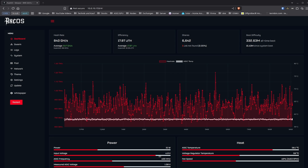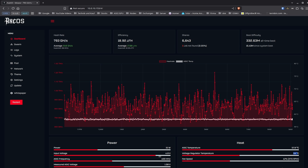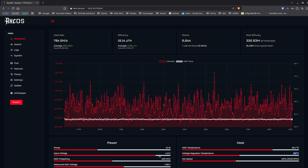Now we're on the PC taking a look at one of my BitX devices. One of the first important things: run your BitX for a couple of hours and then check how it does performance-wise and heat-wise. We can see the ASIC temperature is currently sitting below 60 degrees, and the voltage regulator is also sitting below 60 degrees — the fan is only running at about 46%. If you already see that your ASIC is above 65 degrees Celsius and your voltage regulator is above 70 or 80 degrees Celsius, I would strongly consider using one of those tiny heat sinks.